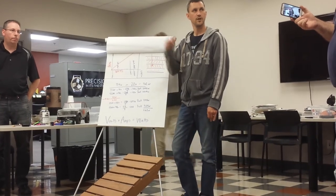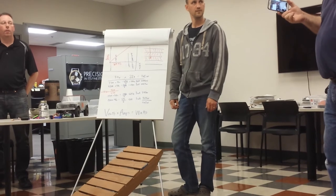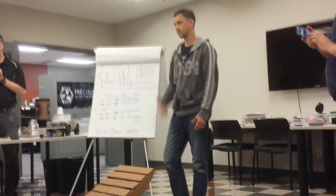It doesn't matter. There's a little electronic module you can get that plugs into your balance connector. It's got a couple of LEDs on it, and if one cell drops too low, it'll set off a little alarm, and you can go down and check it.